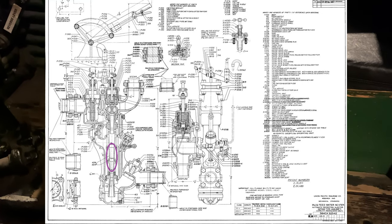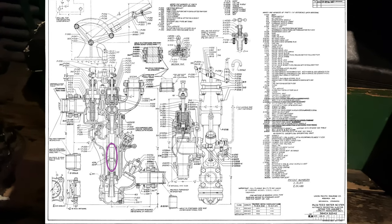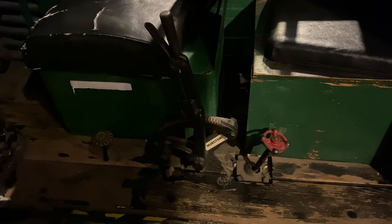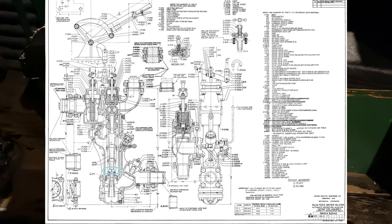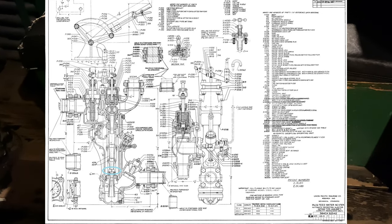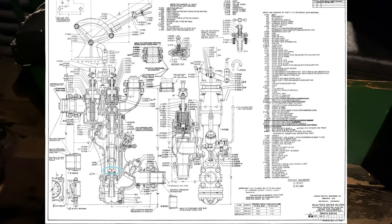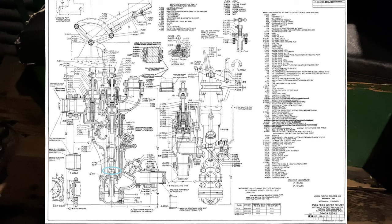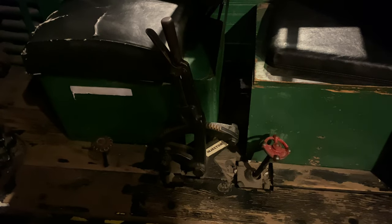While it does that, it condenses into the water and it heats the water up so that you're not injecting ambient temperature water into a 300 or 400 degree boiler, because you don't want to shock the boiler. That's bad for the boiler. But as that's happening, remember I said there was a gap between the combining nozzle and the delivery nozzle. So now that the steam is low pressure, high velocity, and it's going through the combining nozzle at such a high speed that it completely skips through the gap between the combining nozzle and the delivery nozzle.